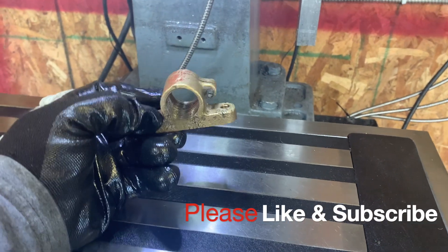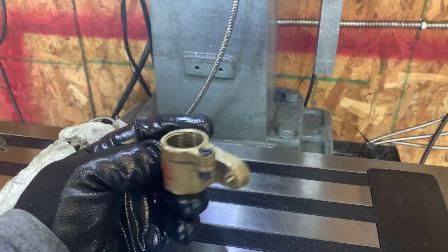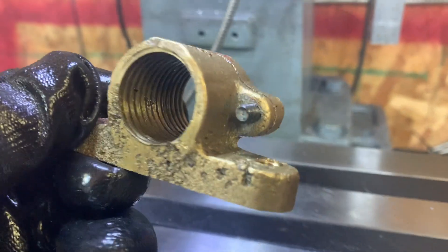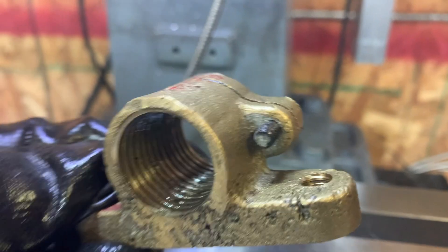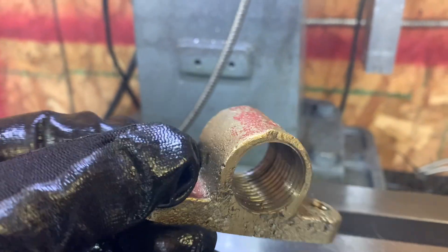Welcome back to Let's Roger That — here's a quick tip for you owners of PDM-30 king milling machines. If you watched my last episode, you've seen that I replaced the lead screw nut for my x-axis, and that is because look at those threads — completely worn out. What's interesting is that they're worn out on one side, and I've been wondering why.